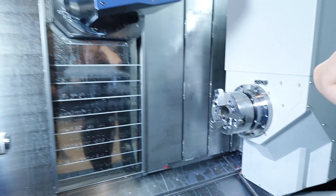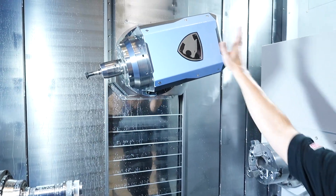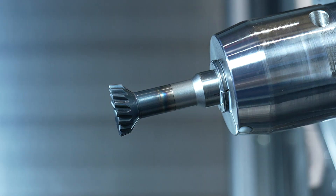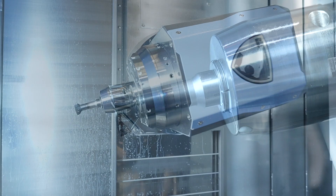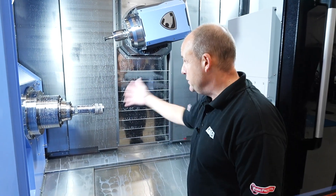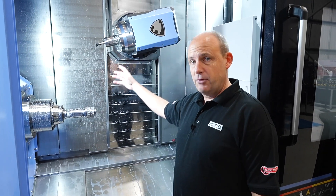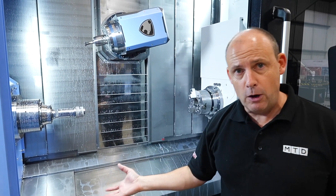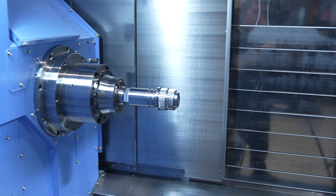The head on this machine is a full B-axis head — this machine is capable of full five-axis simultaneous machining. What's really fascinating, as I talk about the application, is that this machine can actually do gear skiving, which you can see here. Both of these gears are produced using this one tool. The machine also has a spiral grooving operation which is done using five-axis machining.